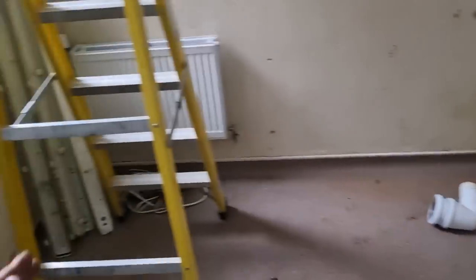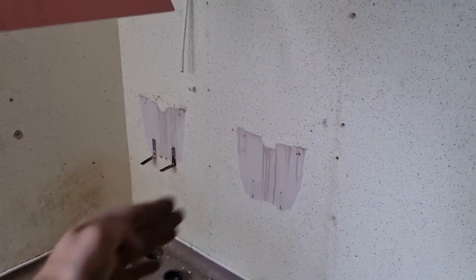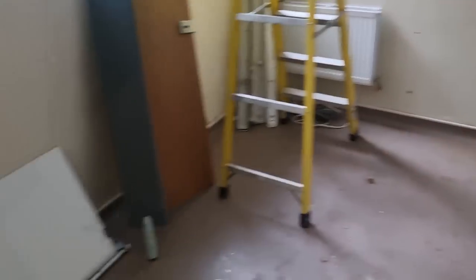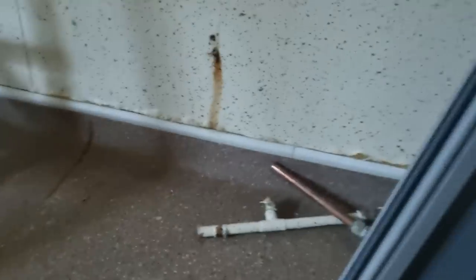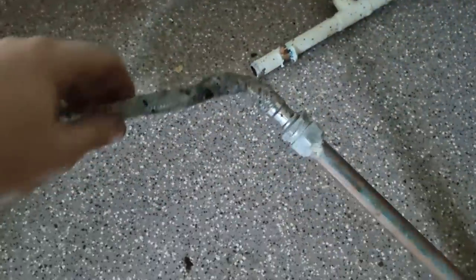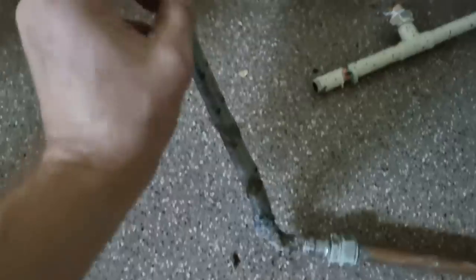We'll get it all sorted — beautiful. We've got new transfer panels going along this back wall with toilets going in here, new cubicle walls, and individual basins in each of the units. Should be a lot better. Absolutely love my wheel barrow when doing jobs like this — saves me no end of time. That's got them all ripped out. The problem with flexes is they spin the tabs, crush the flexi, and then they burst. Some jobs are all right but some jobs they're not.